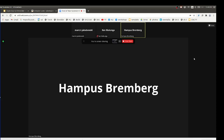When I'm talking about the ports on the valve, I'd say I have an input and an output port from the power cube, and then work ports. Work ports, okay, that's good. In and out, and then work ports. The work ports, yeah, they're both at pressure. But the bidirectional valve has one input with pressurized hydraulic fluid, and then it can switch to go through either that port or that port. It's not like it would suddenly suck back through that valve.